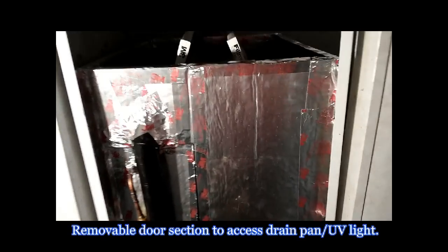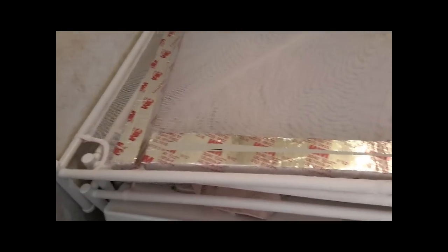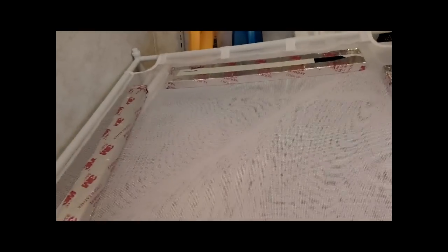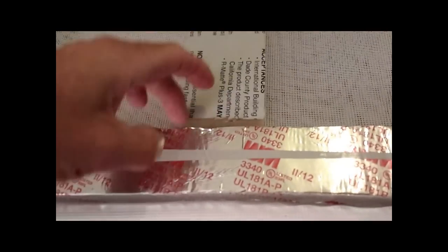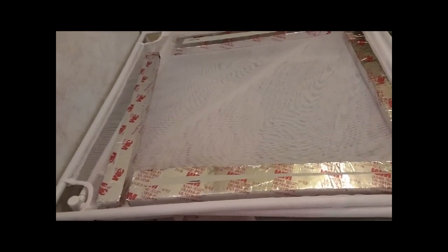I have the front door section started in, just finished putting tape down one side and laying some in right here. I'm going to seal the side here, and then the bottom section down here, and then we'll start building the filter subbase ledge after I finish that. I have all of those pieces already cut and measured out, and I've taped off the open side. I'm going to get a few small pieces — possibly small snips — to give me some vertical support underneath, but it may not be necessary. I'll get the metal tape on it and it might be plenty strong enough to hold the filter up.